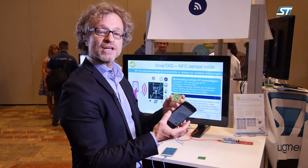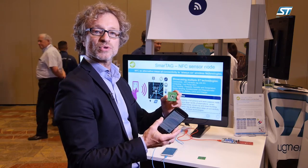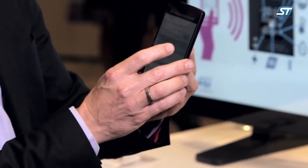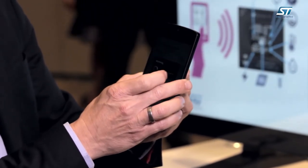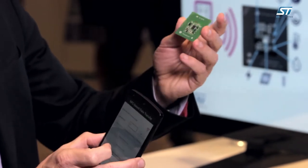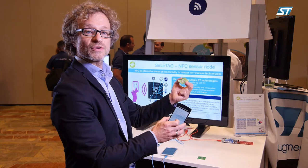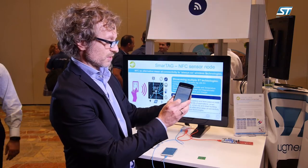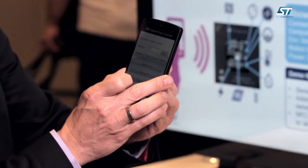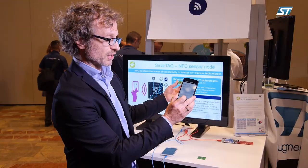The dynamic tag is connected to our low-power microcontroller, all our environmental sensors and motion sensors. In this case, we activate the data logger, we set the sample rate time, we let the system acquire the data from the sensors, and then we re-approach the data logger to the phone and read out all the sensor data.